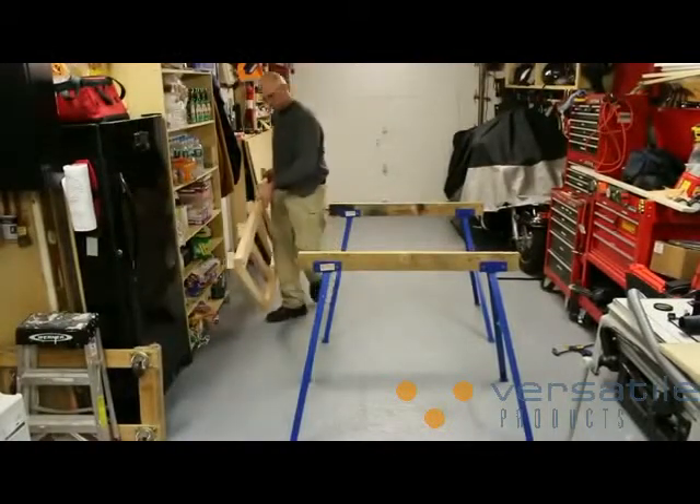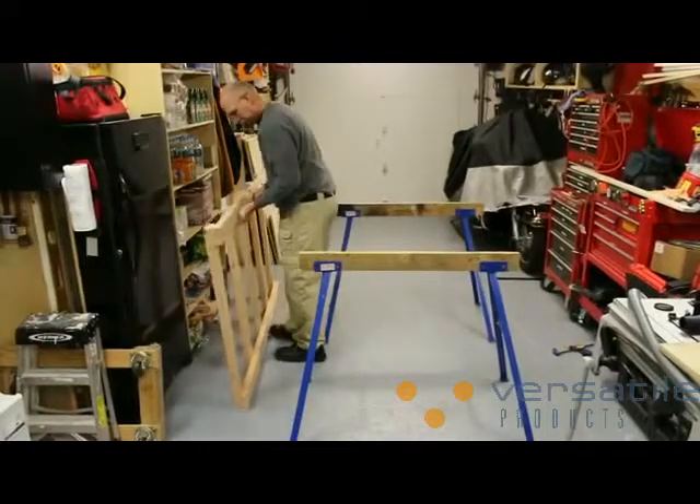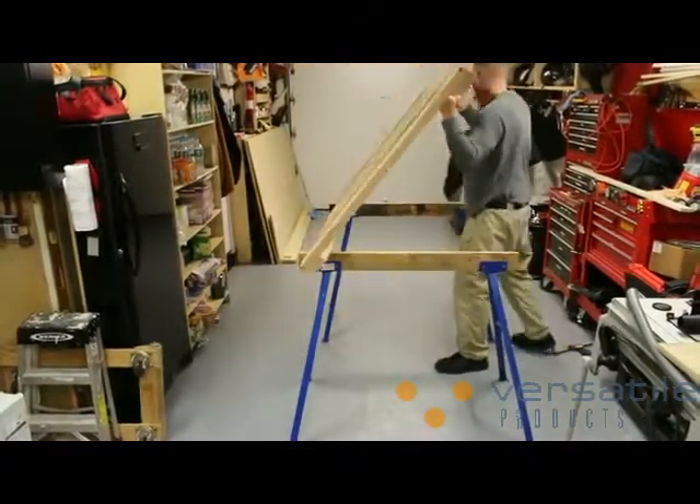My cutting table was designed to be portable. It's made up of a frame of 2x4s fastened together with countersunk carriage bolts. On pivot points, the table can collapse somewhat for transport to the job or just to get it out of the way in the shop, and it sits on a set of standard folding horses.